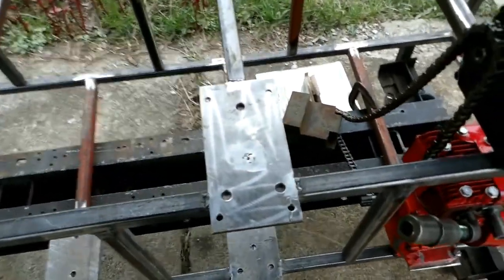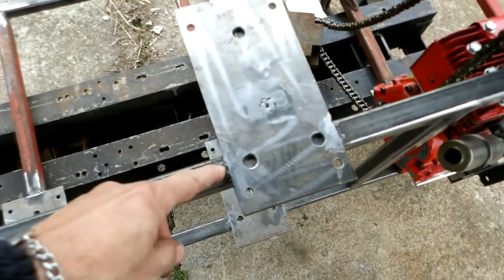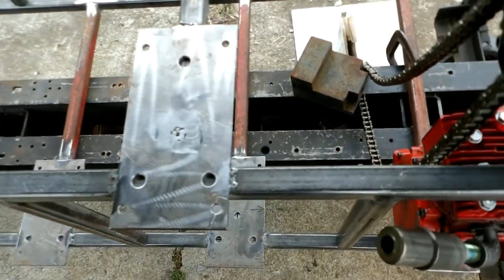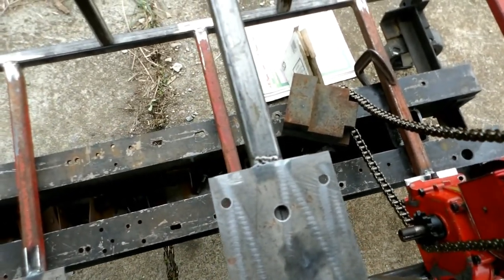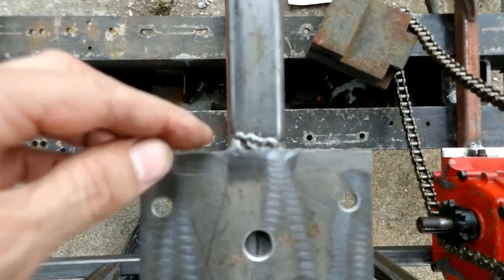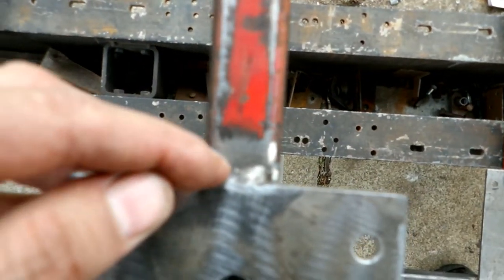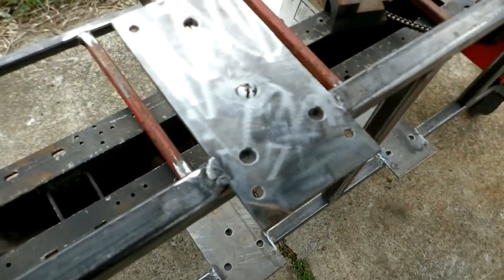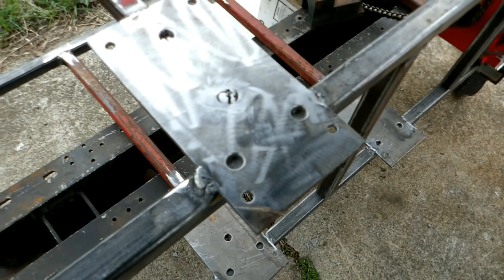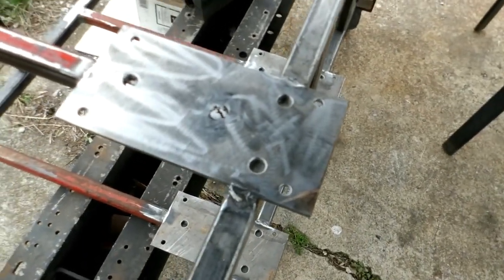I don't know. But I've been learning a lot about what my little MIG welder can and can't do. It's not bad welding things like this with 35 thou flux core, but it's not so good at plug welds. So I switched to 24 thou solid wire for the first time, and see this gobbed up mess here. Underneath it there is a 35 thou flux core weld like that, so it's welded, but then when I tried to weld on top of it, yeah, I don't know. I'm not getting any penetration with the solid wire. It's great for welding thin things, but I seem to have to use flux core to weld, and I've only got an 88 amp welder, so I think that might be part of the problem too.